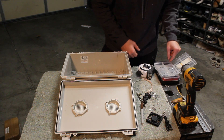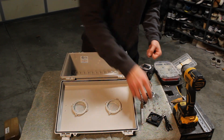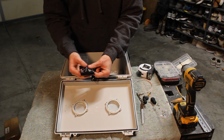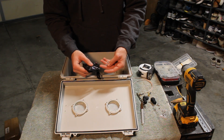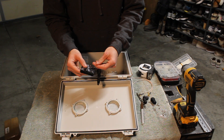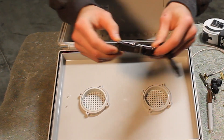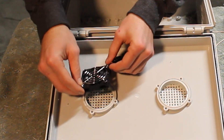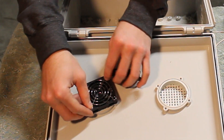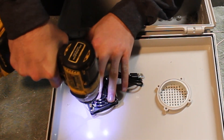The last part of this step is going to be to attach our fan to the vent. I'm looking for two screws that I can use to attach the fan to the vent — I want to make sure that they're long enough to fit through the fan holes and mesh into the plastic of the locking nut. Make sure that when you install this fan you install it in the correct orientation, as the fans are meant to blow air out in a certain direction. There might be an indicator on the fan itself — like an arrow molded into the plastic — that shows which way the air is going to blow. Since this is an exhaust fan, we want to make sure the air is blowing out of the enclosure.